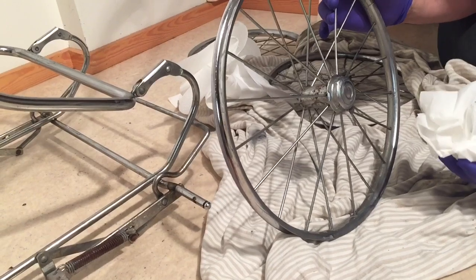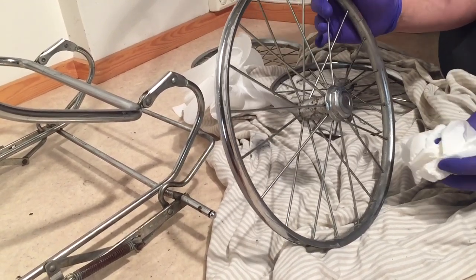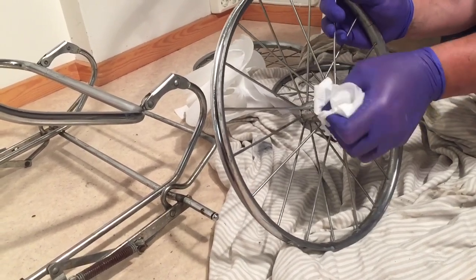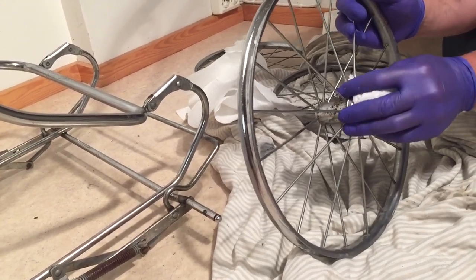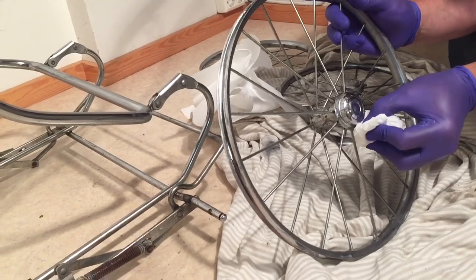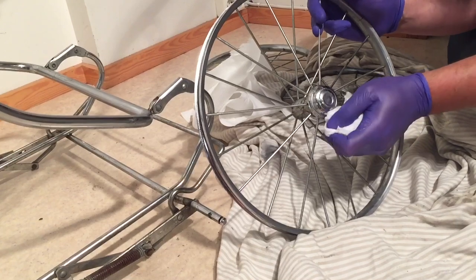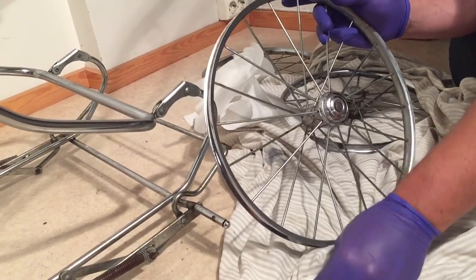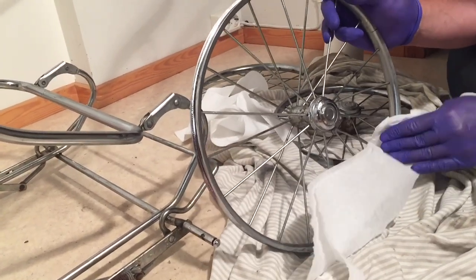But as far as the metal is concerned, you're not at any point going to use water when you're removing this. So what I like to use is either paper towels or toilet paper, something you can get a lot of. The reason for this is you want to start to remove the Rust Eater. It's not something you have to rub really hard, but you want to get it off. And then you want to get rid of that little piece of paper, because as soon as it gets wet from the Rust Eater, you're just reapplying it. So take yourself a roll of paper towels or toilet paper, rip off a whole bunch of little pieces of it and start using them to remove the Rust Eater.